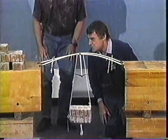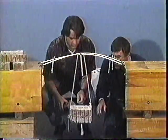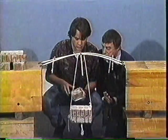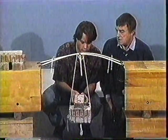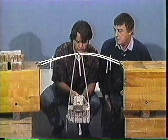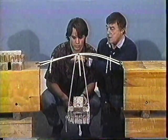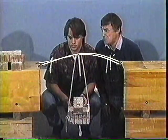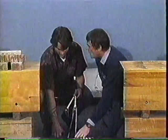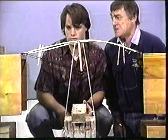I think we'd better put... I can hear some noises — a bit of fatigue, possibly. Let's get number three, which is the design load anyway. If you put it in this way it'll save time, and you can also put it towards the back — see that they're tipping towards the front? So you can compensate a little bit. Now this back one is bending much more than the front one; in fact, this one is bending in the opposite direction. Meanwhile it went over there — we'll have to pick that up on the slow-mo. I think it went where you thought it would. We were looking at the left-hand side, where in fact it broke at the right.